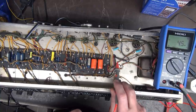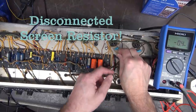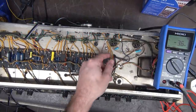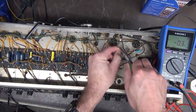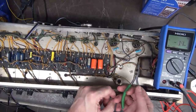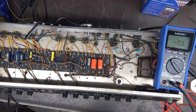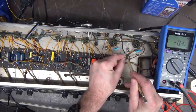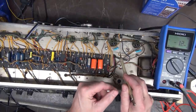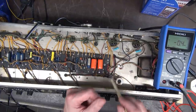Oh, guess what, guys? Take a look right down there. So see there? Lesson learned. These wires that just push through with no mechanical connection could fall out. In this case, it killed one of my output tubes. Wow. Okay. I'm going to get that soldered back in. It's a good thing that this lead popped out instead of this lead popping out with live voltage, right?